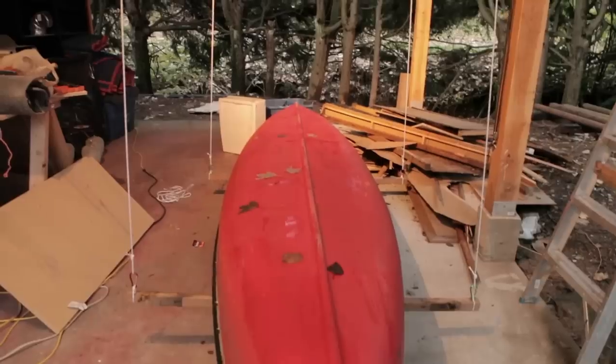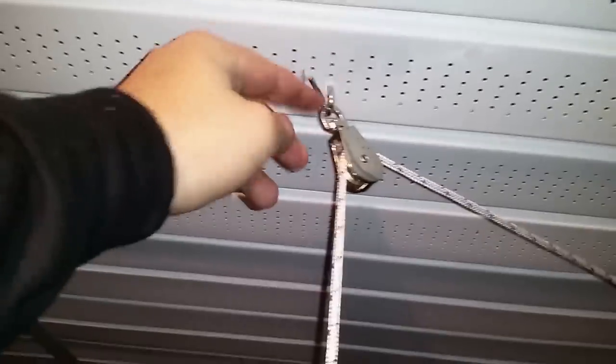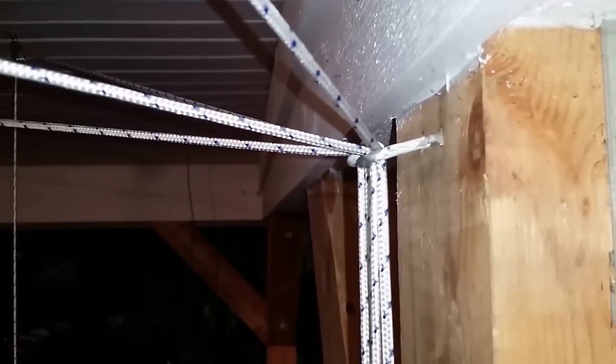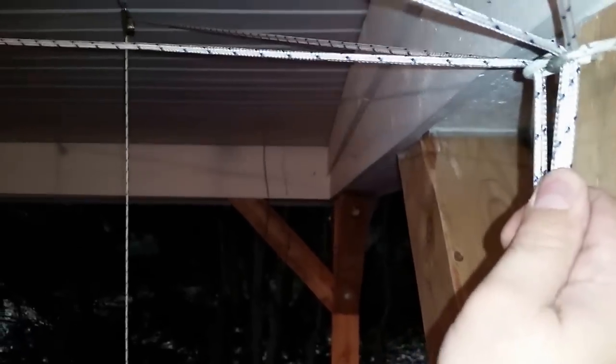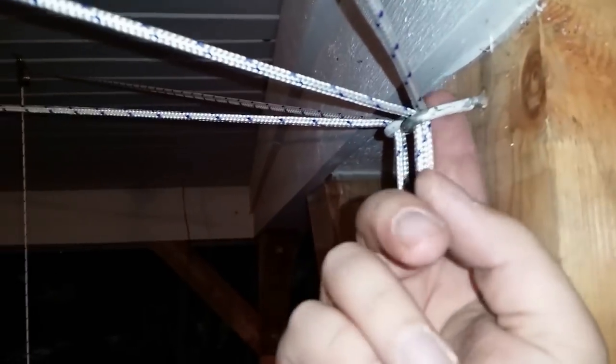First, I found that the width of the boards I'm using to support the canoe is too wide — actually wider than the spacing at the top. The tension on the rope and the pulley was extremely high, pulling too harshly in one direction, and I felt the pigtail bolt probably isn't strong enough long-term. The two placeholder hooks at the center where all the ropes meet are starting to bend from the combined force. When I try to pull on it I can barely make any headway — it's just really heavy. I need to swap this out for something bigger and add a pulley so it's not dragging on the bolt itself.